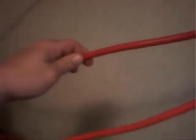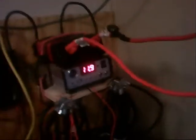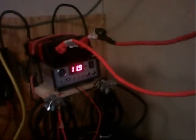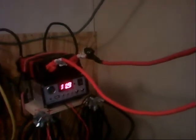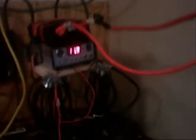gauge extension cord, which I found to be the easiest instead of buying 2 spools of wire or whatever to run my lights to. I gave up on 12 volt lights. For one, they're way expensive to buy, and for two, for the fluorescent ones anyway. It made more sense to just run everything at 115 volts on household current.